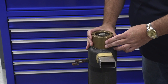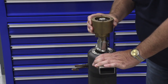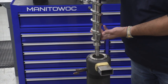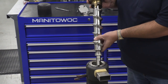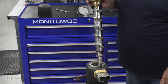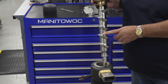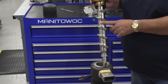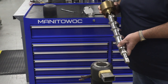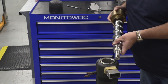The top auger cutter head assembly — I'll just grab that and pull it slowly out of the evaporator, and now you can see the auger. Why would I do this? I'm looking to see if there's any scale on this auger because that gives me a good indication on whether it needs cleaning. This one's nice and clean obviously, so we don't want to see a bunch of white scale on there. I'll also take a look down inside the evaporator barrel to see if I see a lot of scale on there too.